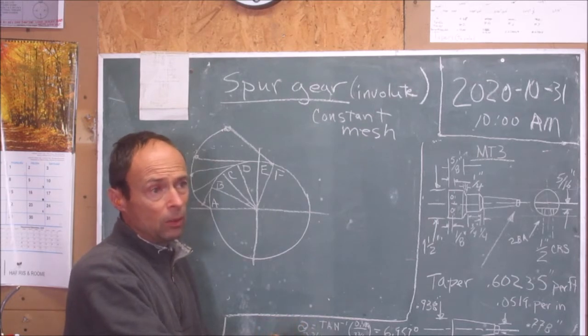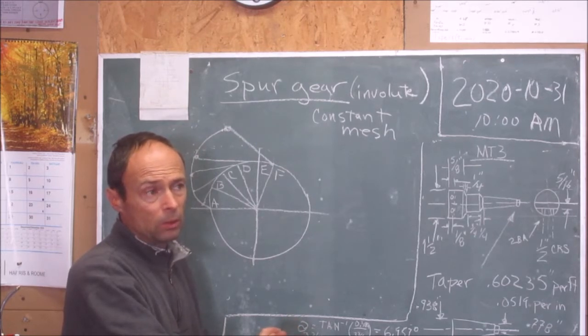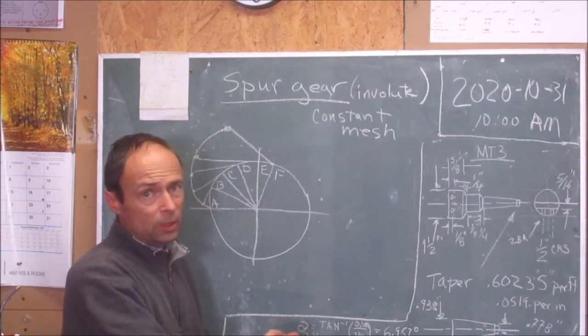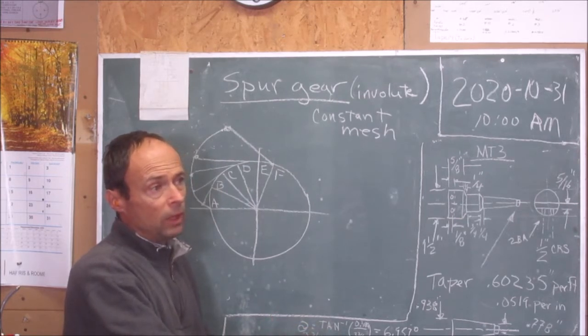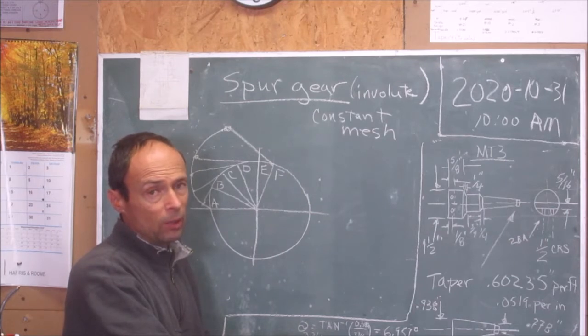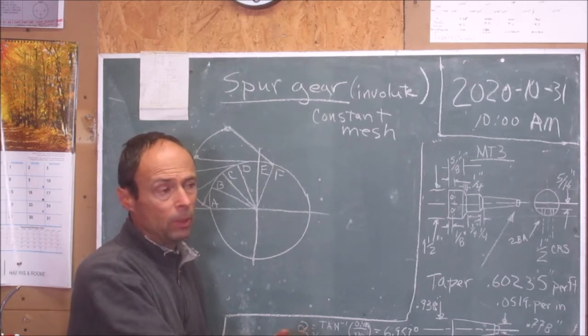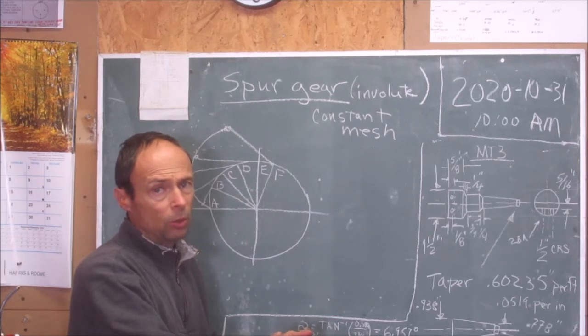Let's say you had a 1 horsepower motor and you have a gear ratio of 1:1 on the input and output. Well, you're getting 1 horsepower on the output, and the torque is going to be the same as the motor. Now, if I had a gear reduction, let's say I have a 3:1, 1 on the input. Then if my input's revolving at 1000 RPM, my output's going to be 1/3, 333.333 RPM. I lose speed, yet I gain torque. And torque is what you need to do work.